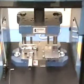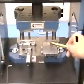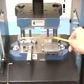Now let's look at the F1B3A, which is a more versatile universal system because the foot length can be infinitely adjusted. This tool will also process one side at a time and consists of a lead cutter for trimming the leads and/or removing the tie bars, mounted alongside a lead former.